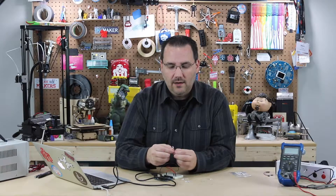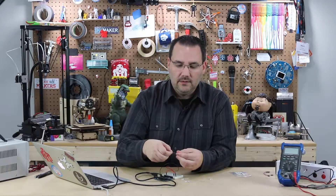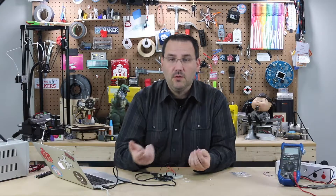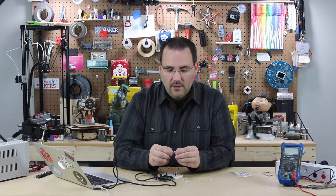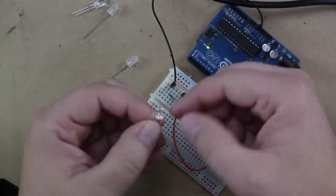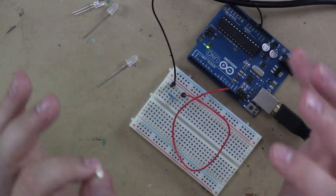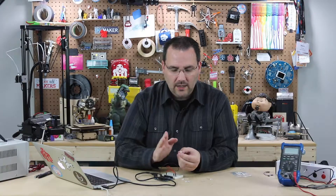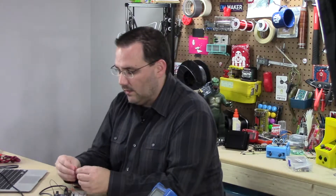You might like that — it might make more sense to have one common ground. I can make one lead connected to pin 13 and the other connected to pin 11, and turn them both on at the same time. If you look inside, you can actually see this LED really has two circuits in there — one cup and then two separate wires going up.